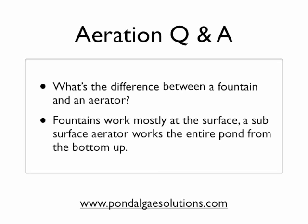Basically, in a fundamental way, a fountain will help increase some aeration in the upper few feet of a pond body. When we talk about pond aeration at Pondology Solutions, we're really referring mostly to subsurface aeration, where we use a land-based pump, an airline, and a diffuser that sits at the bottom of the pond, usually in the deepest area, and it releases very fine bubbled air into the water. It propels it upward, helps break the surface tension a little bit, and it circulates this entire oxygenated water throughout the entire body of the pond. So we get better results, particularly very low, down deep in deeper ponds, when we aerate from the bottom compared to a surface fountain.